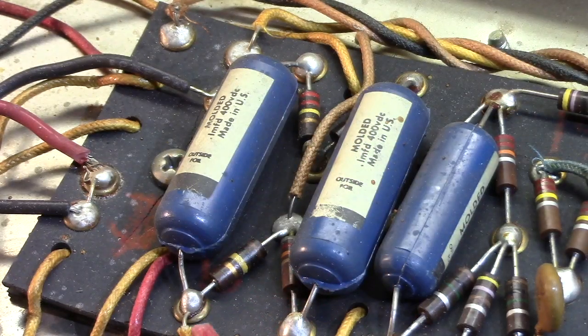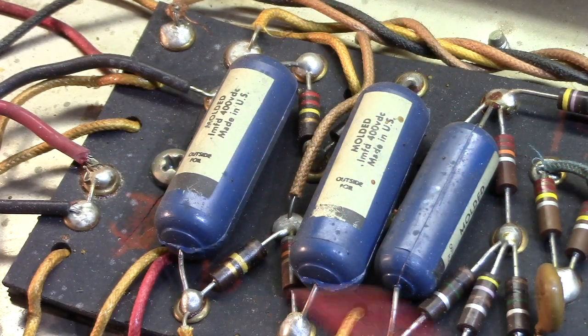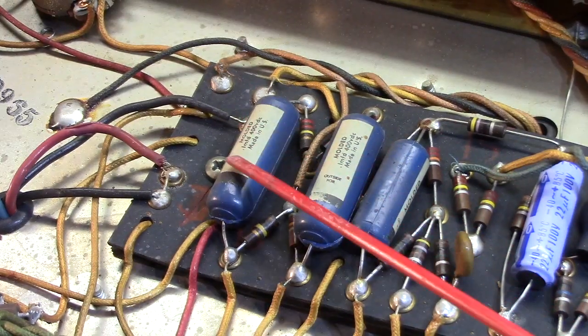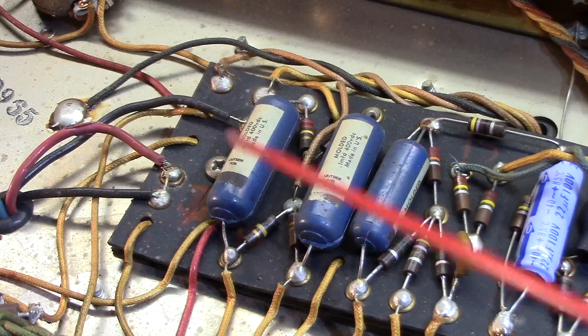And then also your phase inverter plate resistors down here, this 100K and 82K. Those typically get replaced along with these caps. Usually I do a scorched earth down here because that's a stability section of the amplifier. The blue sausages in these positions don't necessarily lend that much to the overall feel of an amp, so I don't feel bad about pulling those if I have to.